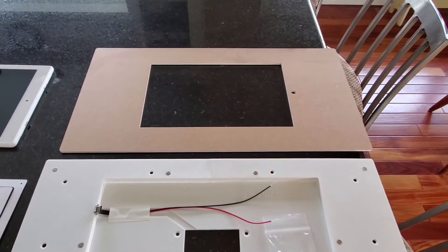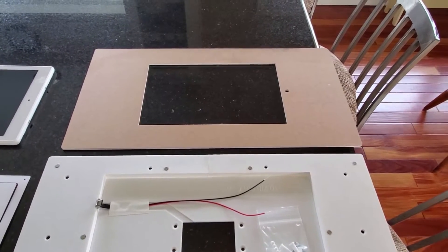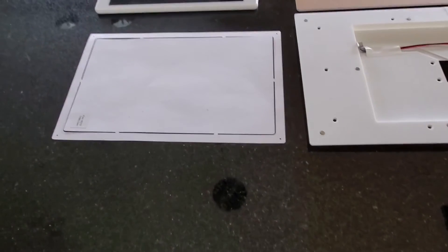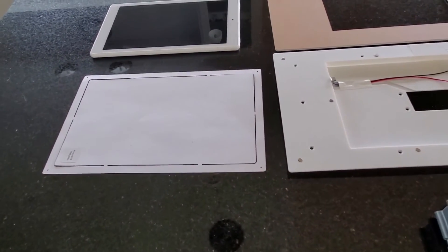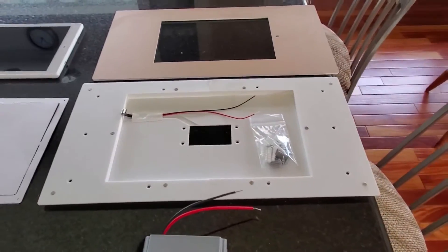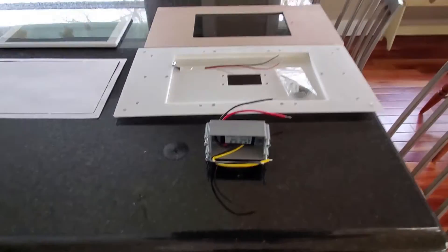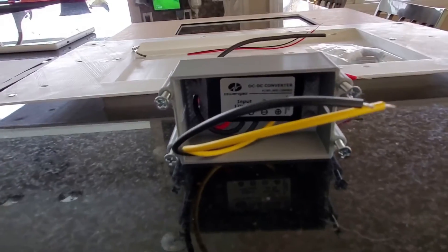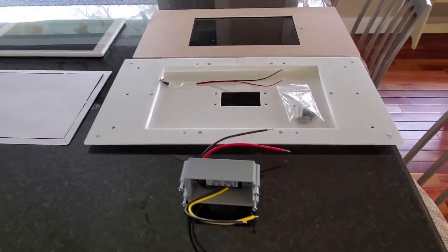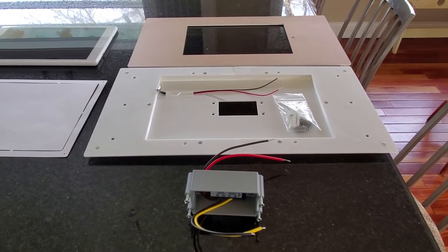This part physically mounts to the wall; this is the surface fascia — it's acrylic and still has the protective backing paper on it. We'll take that off as a final step. He also supplied a template, though it's not necessary here since we're not cutting drywall — we're mounting directly to those 2x4 studs. I selected the 5-volt option, and here you can see the 12-volt to 5-volt converter that comes with the kit. Alternatively, you could select a 110 power supply to work directly.